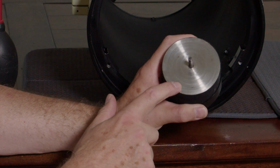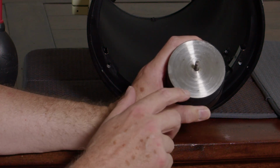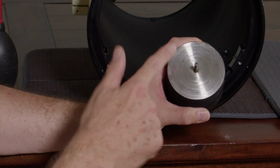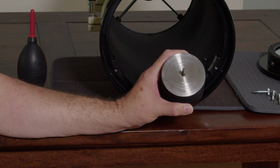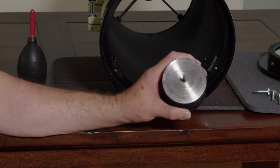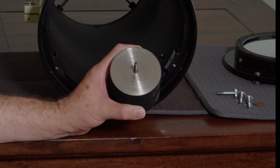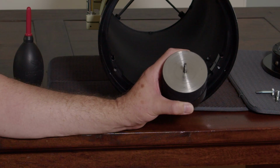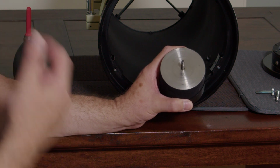Why? One of the issues you'll find, especially when you've got a second-hand telescope, is that when you remove the secondary, you need to check the back of it for dimples, dints. If somebody has been over cranking those grub screws, trying to collimate the telescope, and in their frustration they've applied too much force, then even aircraft grade aluminium, or whatever aluminium this is made from, will not stand up to that, because you have a steel bolt pushing against an aluminium surface. And this is maybe your first clue to why you might not be able to collimate your Epsilon.